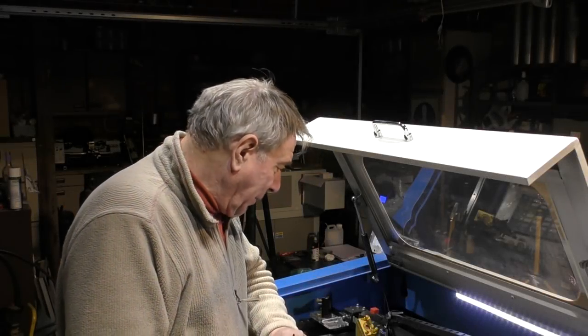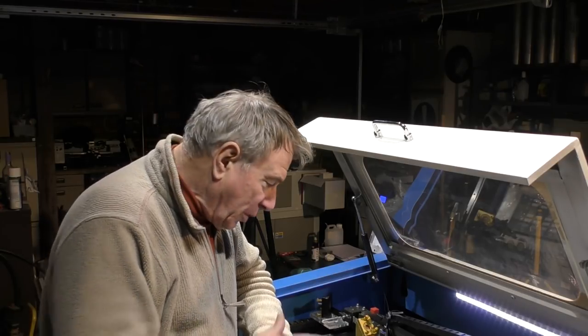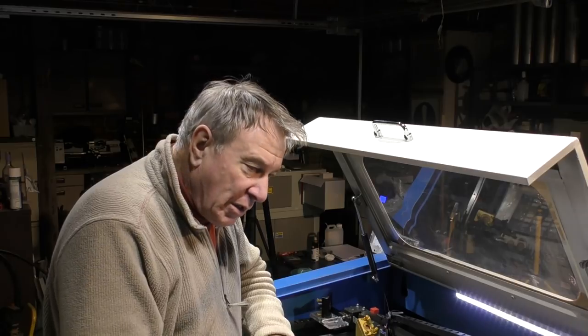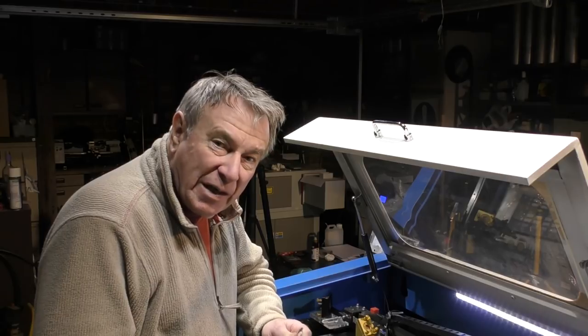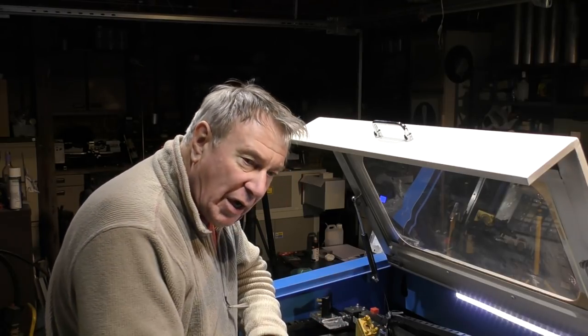Welcome to another RDWorks Learning Lab. Today we're going to carry on with our engraving on mineral materials. If you remember last time, we selected slate as being the most likely material to give us some good results. Today we're going to start off in a logical way and try to work out what size dots we can get on this material. We're going to use our standard 254 pixels per inch, which basically gives us a 0.1 pixel, and we're going to use the pattern we've used previously to try and establish dot size.